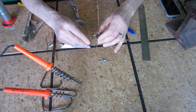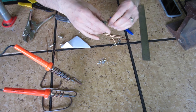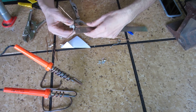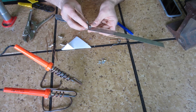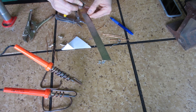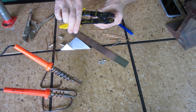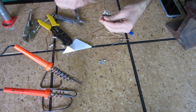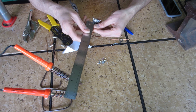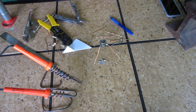Not pretty, but it'll work. Straighten them out and then we'll trim the length down. The radials can be a little bit longer than 68 millimeters — it's the length of the antenna element that's the key length you want to be 68 millimeters. You'll measure that from where it comes out of the connector, measure out 68 millimeters, and cut it right there. So I've got an extra 3mm here — 68 minus 3 is 65 — I'll trim it right about here with my wire cutter. Then just do the same thing with all the radials. Pretty simple, pretty easy, and you'll be done in a few seconds.